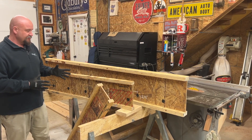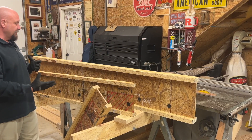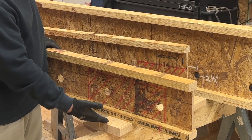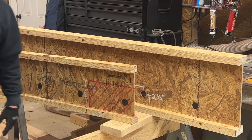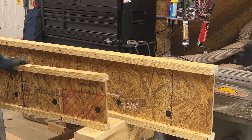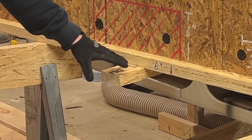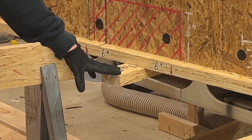Welcome back into the shop everyone. My name is Steve Rudowski and I'm the territory manager for Trus Joist Weyerhaeuser in Philadelphia, Pennsylvania. What I have before you today is a couple different series and sizes of TJI I-Joists mocked up: a 9.5-inch 210 showing as a cantilever, an 11-7/8-inch 210 showing with an end bearing, and a 16-inch 560 showing a center bearing — a continuous I-Joist over a center bearing wall or possibly a beam.